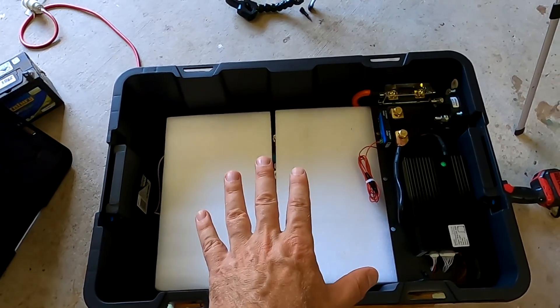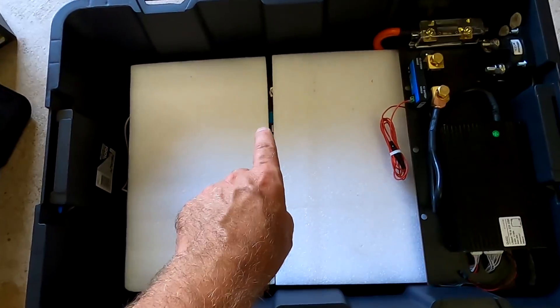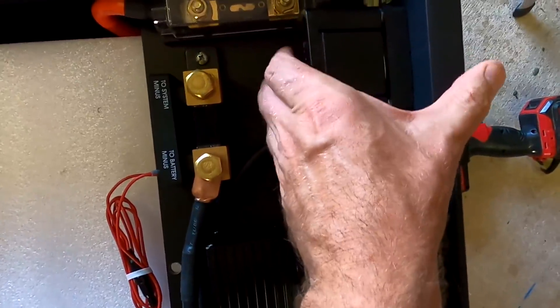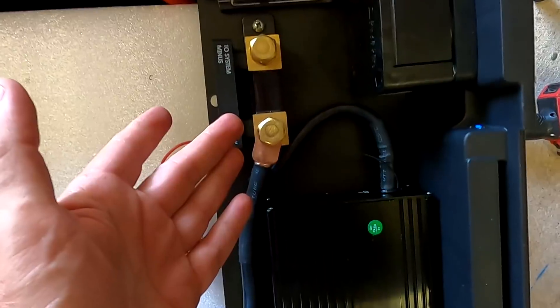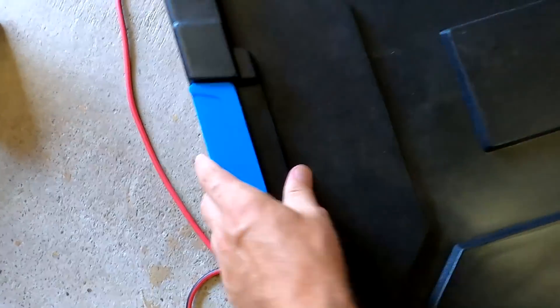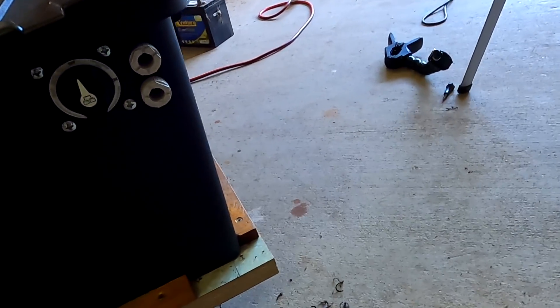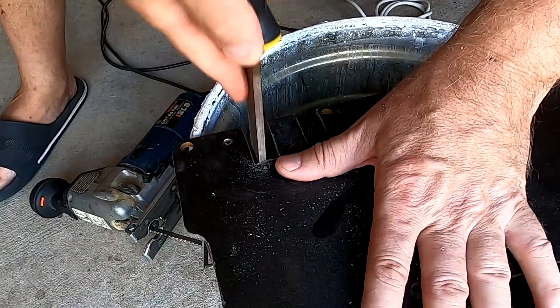I'm not leaving this foam on top — there'll be a clear plastic shroud over the batteries so even if you lift the lid you can't touch any terminals. The switch will be covered on the positive side; the negative terminals I can't see any problems with, but I may build something to cover those too. This took me the whole afternoon — cutting out the board with the jigsaw, filing it down, crimping all the cables. There's so much mechanical work fitting everything into the box, which is why this is now a five-part series. But I think we've covered all the aspects.